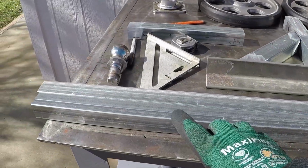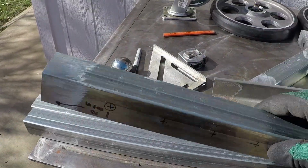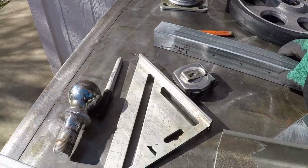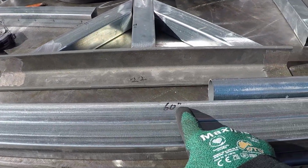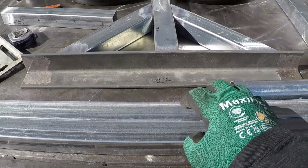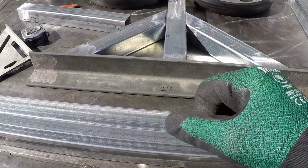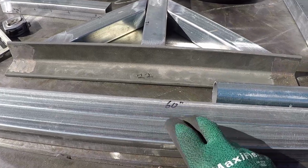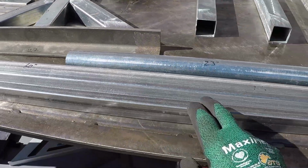And finally, the handle is made from the same material as this one, 1.5 inch square tubing. The main piece is going to be 5 feet in length. The longer this piece, the easier it is to carry the trailer. So I'll leave this one at its length, 5 feet. And the other one,